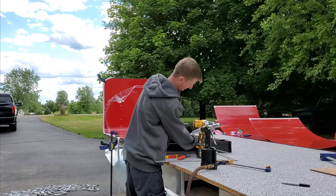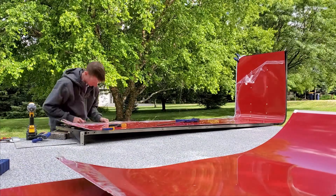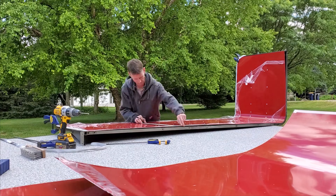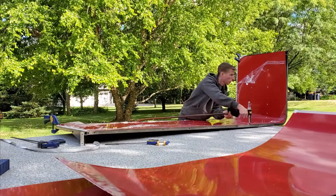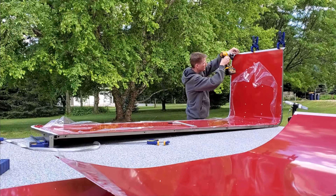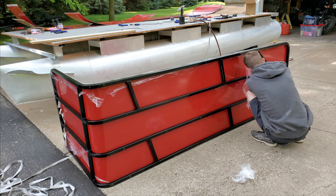When I got to the end, one thing you can do with sheet metal is score a straight line with a utility knife and flex the panel to break it cleanly — a lot easier than running snips the whole way. Then I used sheet metal snips to cut the radius in the corner where the doors meet, giving a nice rounded edge and a clean square cut down the long side.